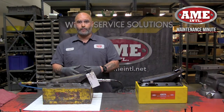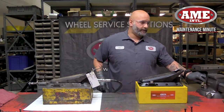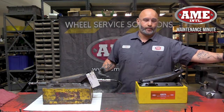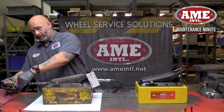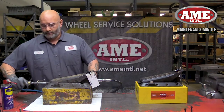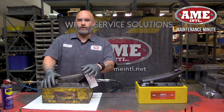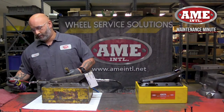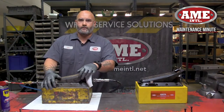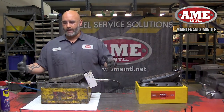That right there is because the air motor is pretty much bone dry. Quick tip: what you want to do if you're in the field — if you have standard air tool oil, if you've got air tools on your vehicle, use that. But in a pinch, grab some WD-40 and give it a couple of squirts. You can hook air back up and run the pump a handful of times. Work it a little bit, give it a couple more squirts, and that will stop the bypassing of air.